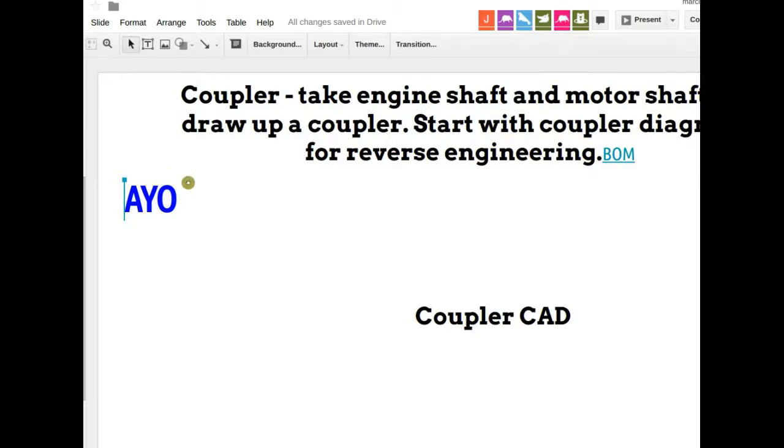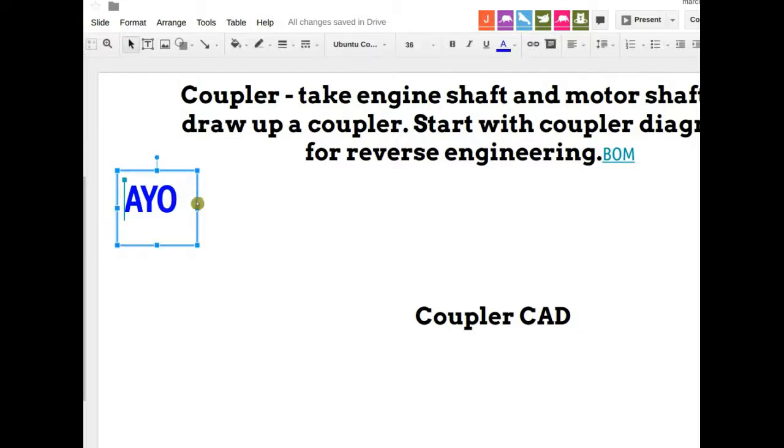That's the critical point. In other words, you try to get the dimensions as close to the real one as possible, so that when you do the CAD, it's actually telling you the complete story, as opposed to doing it in CAD and finding out, oops, in reality you cannot build it because it's a little different. So that's where you want to take a look at the dimension drawings online and draw that up as closely as possible, or possibly Google up something on GrabCAD, that's a 3D CAD repository, things like that.